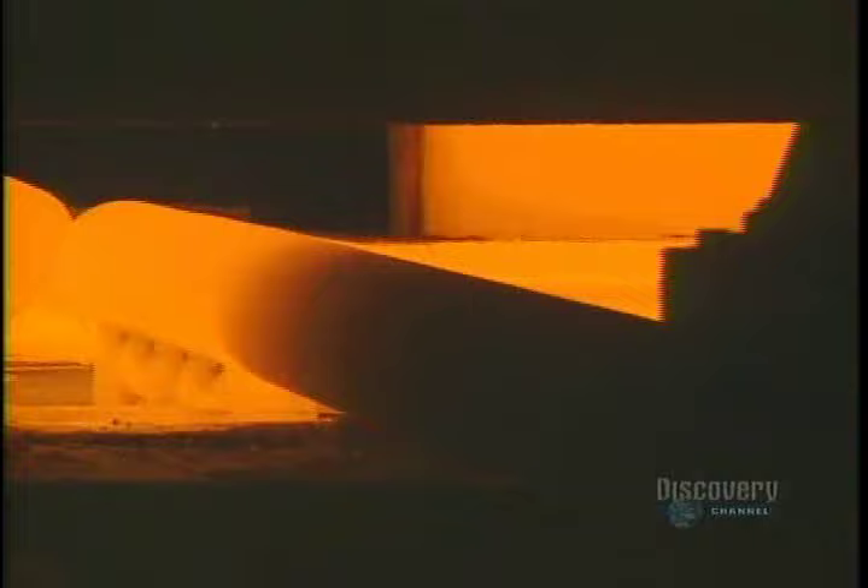In this regenerating chamber, combustion air is preheated to 1,000 degrees. The materials of the mix begin fusing, and the molten glass is stirred up. The homogenizer mixes the glass to equalize its temperature. Pouring will be done within several hours.